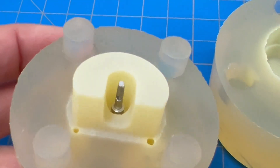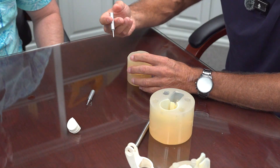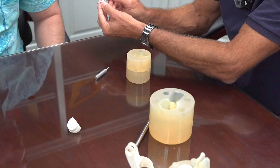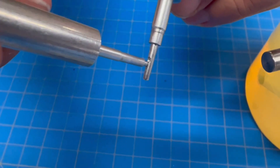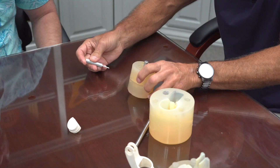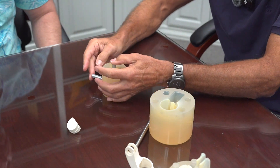In this particular case, we slide these two here — we've got this pin. This one goes down and it's keyed. There's a little key here so it's set right because there's a little dimple here that it interfaces with. That goes there, and then from this side, this will key into that other section so you have a through hole. That was necessary for this part. And then there are four vents and a sprue.